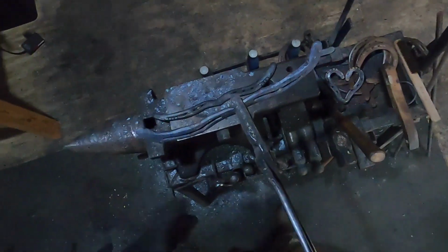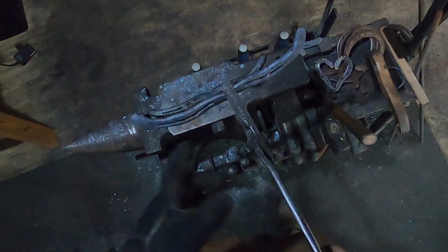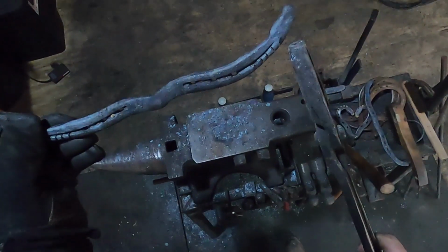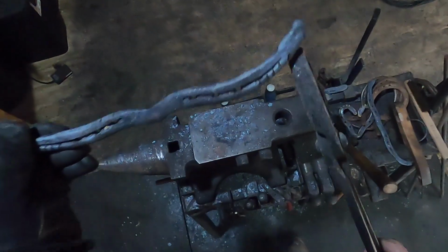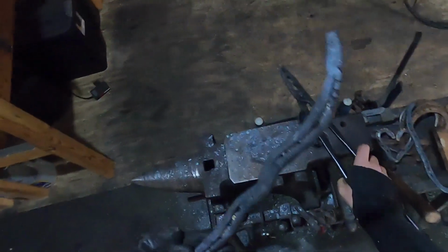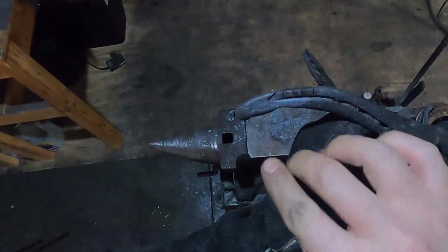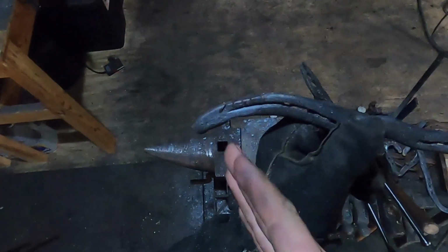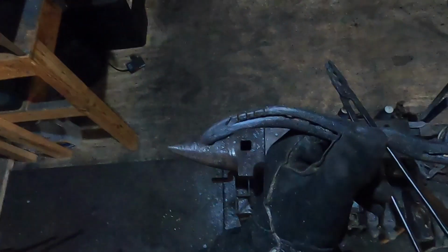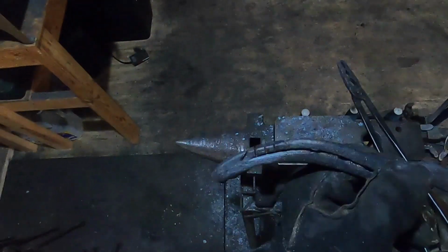As you can see here, I have finished putting both heads on the horseshoe. After which you want to let it cool down so you are able to put notches in for the mane and the ears. I put a notch in backwards there, as the ears go back, and 4 notches to help simulate the mane, though you can put in as many notches as you would like, depending on how you would like the mane to be styled.